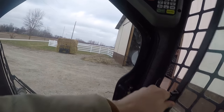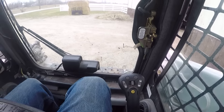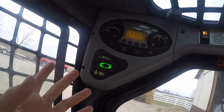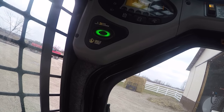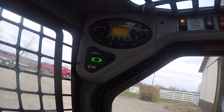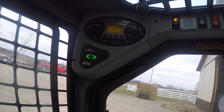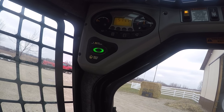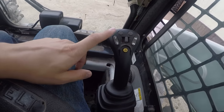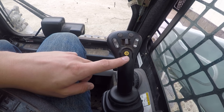What's going on is there's something with the joystick on the right side - they're all electronic. It acts up all year and the day we decide to bring it into the dealership it decides to stop acting up. We'll probably still have them look at it and plug their computer in, because it's been throwing a code saying the right joystick is not neutral.